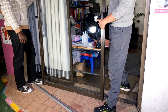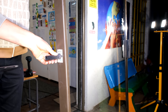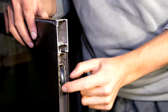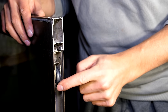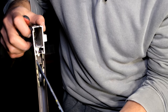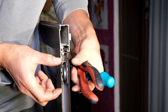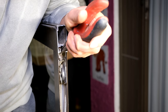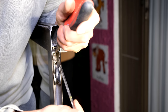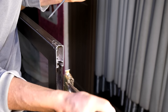We're going to take the sliding door off and flip it so we can get to the wheels. It'll be easier to work if we just take this little stopper off. There's the old wheel — just rotating it with my finger I can see that it is faulty. I'm going to pull it out. On the side there's a little lip that needs to be lifted. I'm going to use long-nose pliers to pull it out straight. If yours is a bit stuck you can use a screwdriver to help clear that lip, then pull it out.